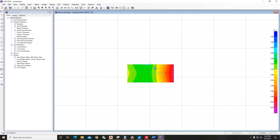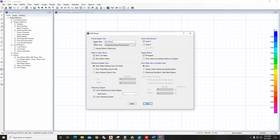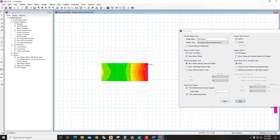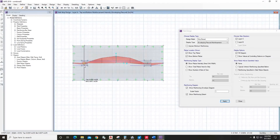If you don't see a control diagram like this, there is definitely some error. Go to Display, Show Slab Designs. There are many ways to view the reinforcement — for now view in area per bar unit width. Select Layer A and apply — you can see the bottom and top bar. The bottom is showing 0.11 square inches per foot and the top is showing 0.07 square inches per foot.